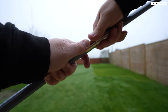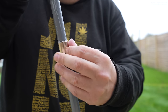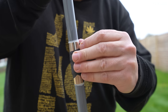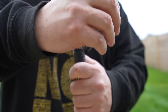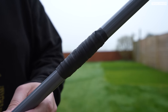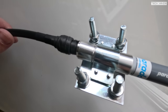Attaching the halves of the antenna is fairly simple — they just screw together. Make sure you get it square on when tightening to avoid damaging the threads. Once it's tightly screwed together, apply a good helping of self-amalgamating tape to ensure no water ingress happens over time. The last thing you want is for the antenna's performance to deteriorate due to water getting into that center join when it's installed 30 feet in the air. I'd also recommend applying some tape at the coax connection at the bottom for extra protection.